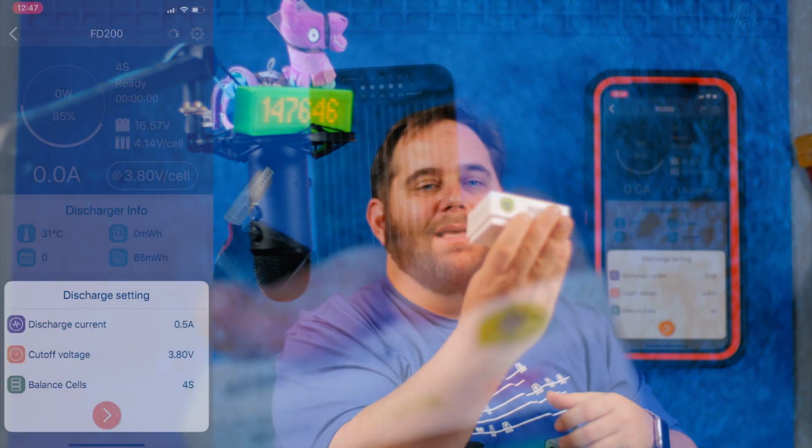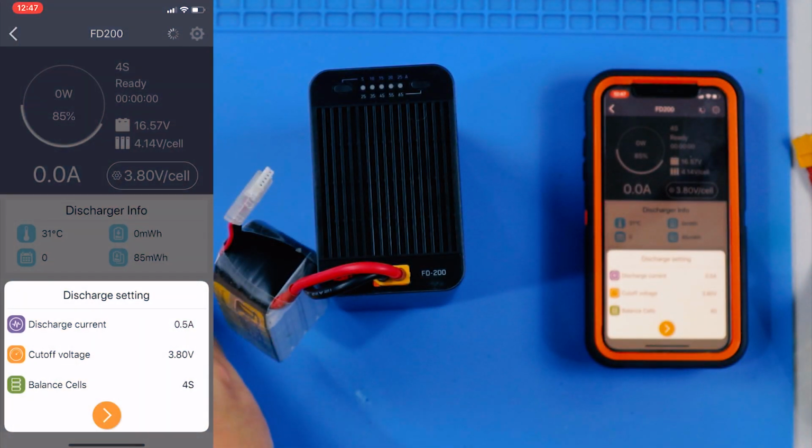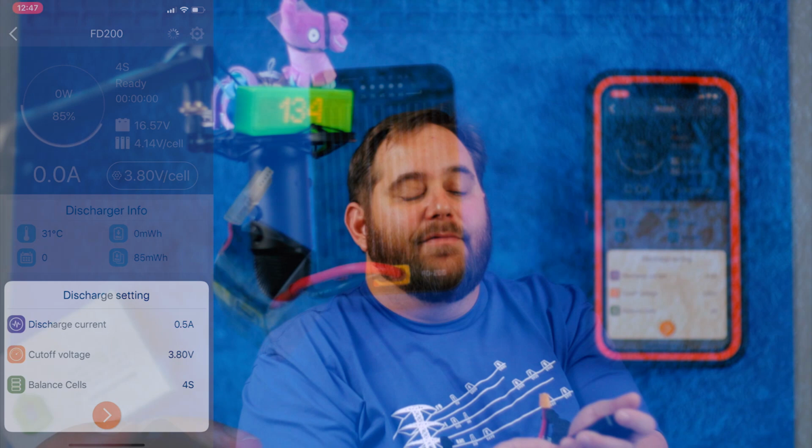However, the one thing you have to realize, if these are batteries that you were planning to charge and fly on a quad, and you put them on the quad and flew it, the quad doesn't have a balance tap, so you would have over discharged the battery in the quad. So if you have a suspect battery and you over discharge one of the cells because it's not properly balanced, it's kind of your own fault, because you should know which batteries are suspect, and have a unit like this guy, one of these deals where you can plug a battery onto it and do your own monitoring of where your cells are at before you start just blindly discharging something.